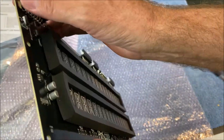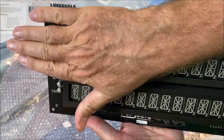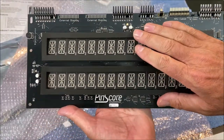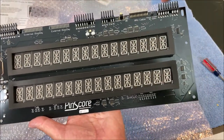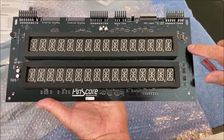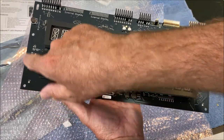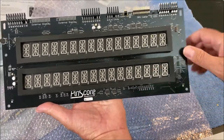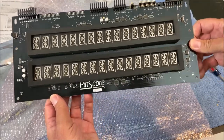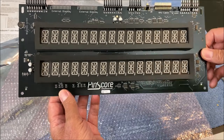The brightness control is installed a little crooked on mine, so it's not as easy to adjust once it's in the game — but that's life, not everything's perfect. The board is ready to go in. There are five connectors, matching the five I pulled off the old score display, and four screw holes. The only other thing is transferring the standoffs from the old PCB so the board stands away from the speaker panel — the instructions don't mention that, but it's no big deal. It looks fantastic — the LEDs, the black matte behind the digits, it looks great.